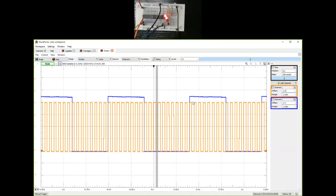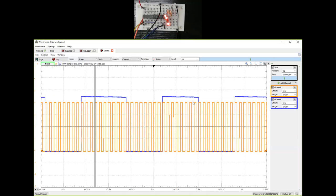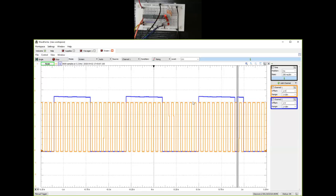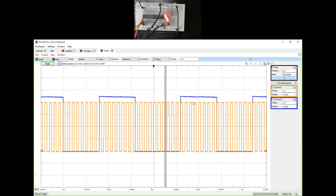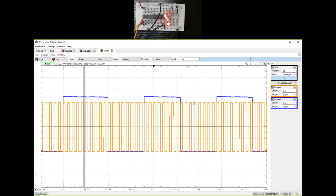Now when you look at this plot, I hope the reasoning for looking at 50 clock cycles is very clear now. See, when you didn't change the clock, you just looked at the same clock 50 cycles, and we have kept cycling through the outputs q0, q1, q2, q3. And that's how we are exploring this 4-bit counter using the chip 74393.